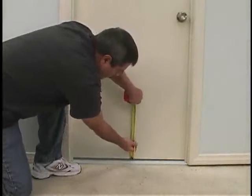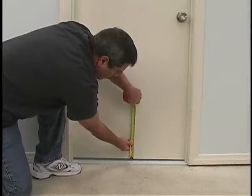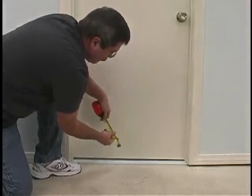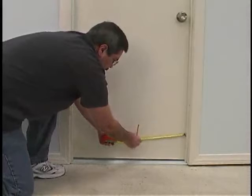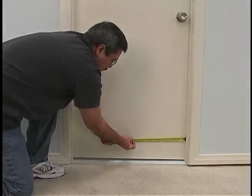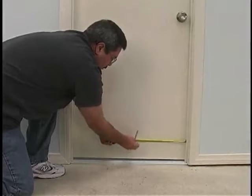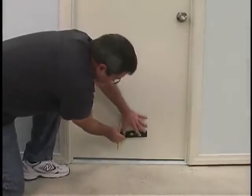Using a pencil and measuring tape, mark a point near the center of the door at least 4 inches from the bottom. The door should not be set lower than that. Then use the tape measure to mark the center point of the door at the same level as the 4-inch mark, or higher if your door will be too low for the pet's shoulder to fit easily. Mark the bottom edge with a pencil using a level or straight edge.